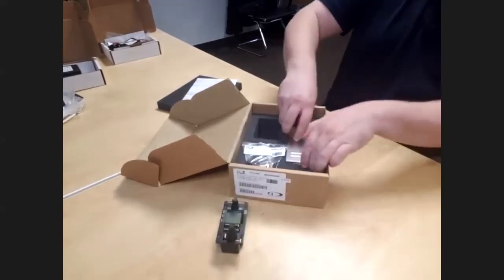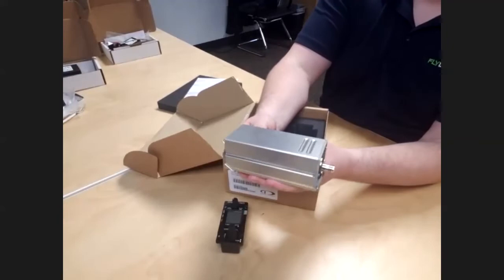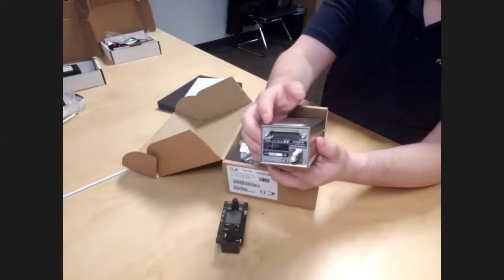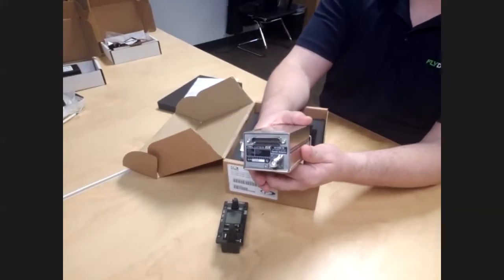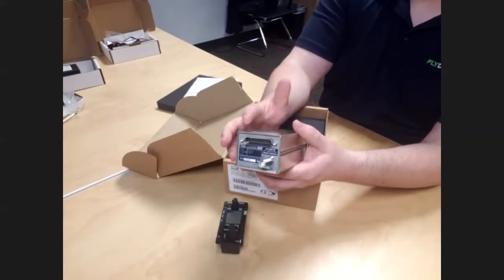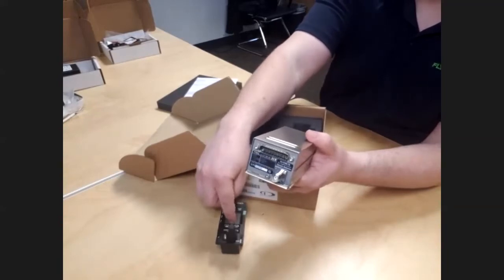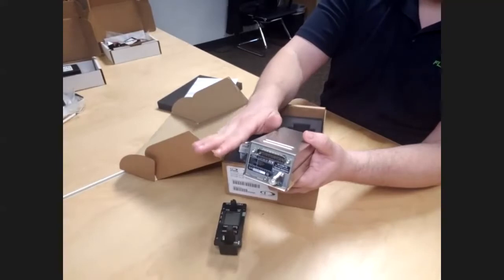So that's the part you actually touch in the airplane. This guy is the transceiver itself, and you'll see it's a lot like the transponder in terms of size and shape. Similar connectivity as well. You've got one connector kit that's going to go to things like push-to-talk switches and intercom, headset jack. A few of those wires will also go from the radio to the control panel itself. And that's how this control panel can control this radio, even with nothing else connected to it.